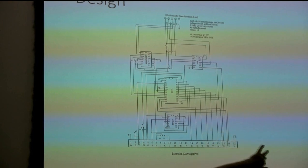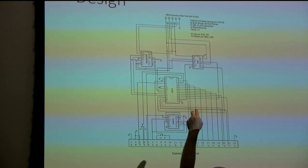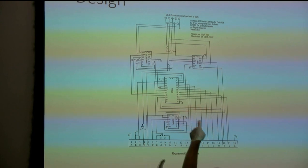There's also a chip for all the signal lines coming in - the incoming data at the top. The chip on the right side is translating the voltage level down to the 0-to-5 standard that every other chip on the computer uses.